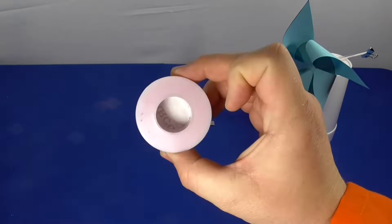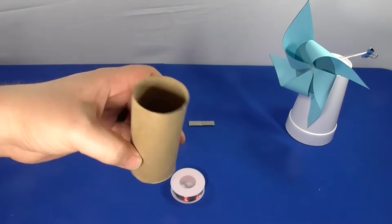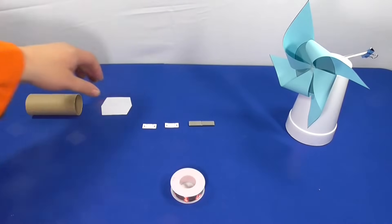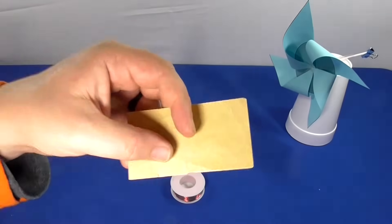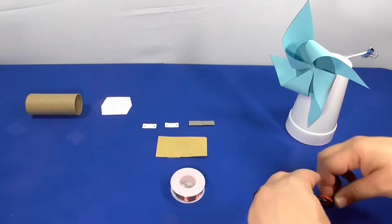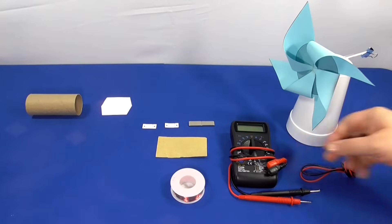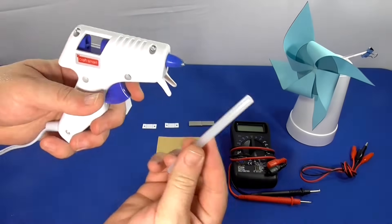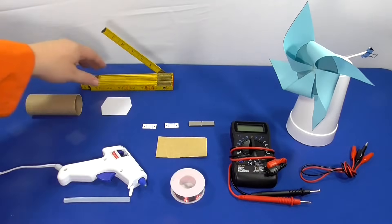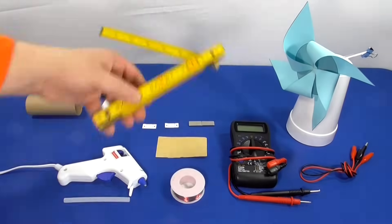As the magnets spin, they'll attract and repel electrons, which will push their charge through this magnetic wire. All of this will take place in our nacelle, or toilet paper roll in this case. To help make that transformation from toilet paper to nacelle, you'll need to print and cut out the nacelle template. That magnetic wire has an enamel or paint on it that you'll use sandpaper to sand off. The sanded wire will give you a conductive surface to connect your two alligator clips, which will connect to the multimeter to tell us our voltage output — how much electricity we're generating. To put it all together, you'll need a few tools including a hot glue gun with glue sticks, a ruler or measuring tape, a good pair of scissors, and a roll of thinner masking tape. All right, let's get building.